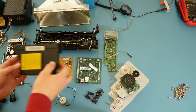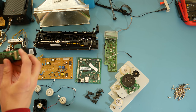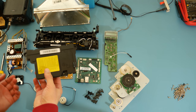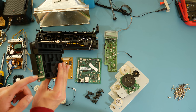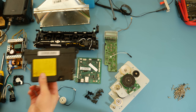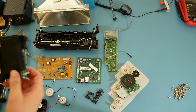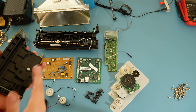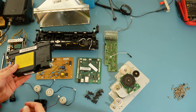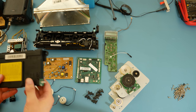And the infrared laser orienting motor assembly. Super cool. I think there's a stepper motor in here and a laser diode allowing it to tip back and forth. Yep. Connects with a ZIF cable. If you're interested in getting this laser module fired up doing something neat, right now it has an infrared laser in there, which one can blind you and two doesn't look very cool on the wall. But I think based on the orientation, you should be able to make a pretty cool laser kind of sweeping back and forth, pretty cool effect. So if you're interested in getting this module, looks like you could swap out the laser diode with a different one. Could be able to make something pretty cool out of this.